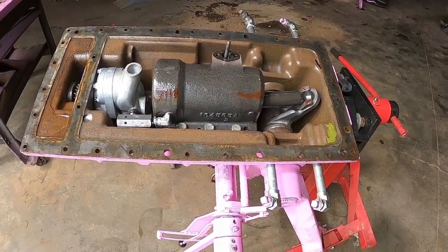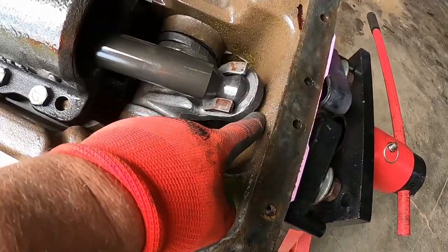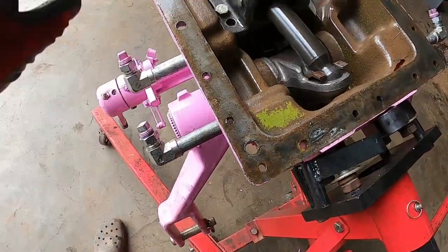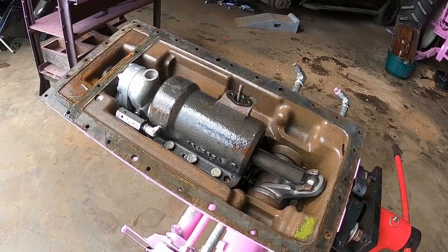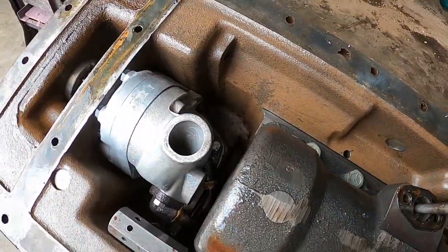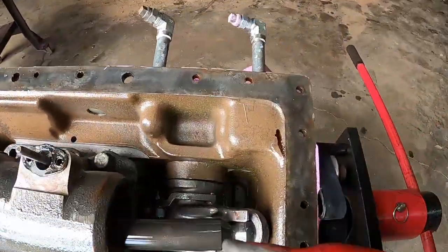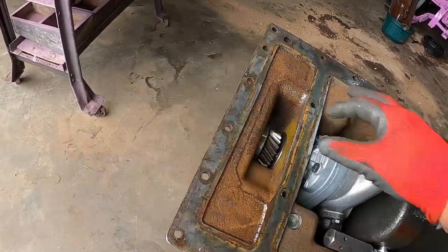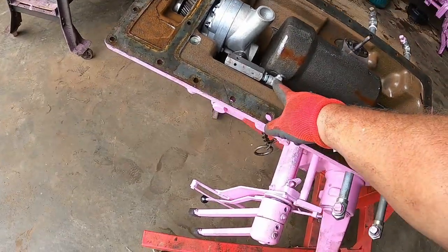There's the three-point lift cylinder on the internal lift cylinder. This lift arm here will hit the back of the case keeping it from going too far, but on the ones with external cylinders there's nothing stopping it — and trust me, I've broken them before. These arms can keep swinging around and that little aluminum link will suffer the consequences. With a newer-style pump I might be able to get it out without pulling the three-point cylinder.